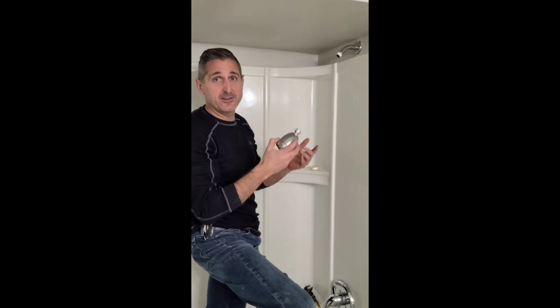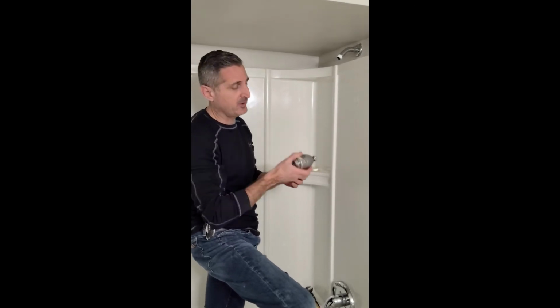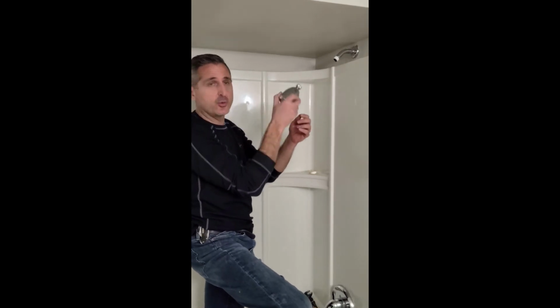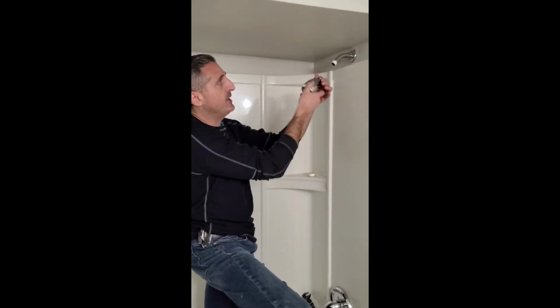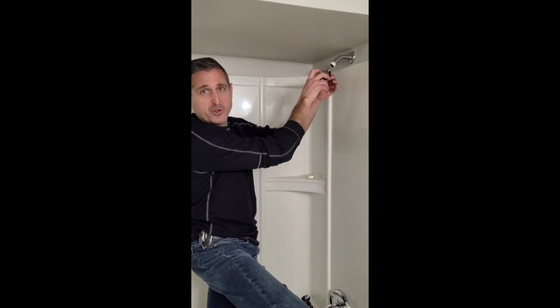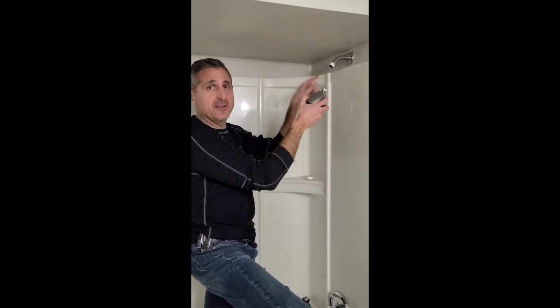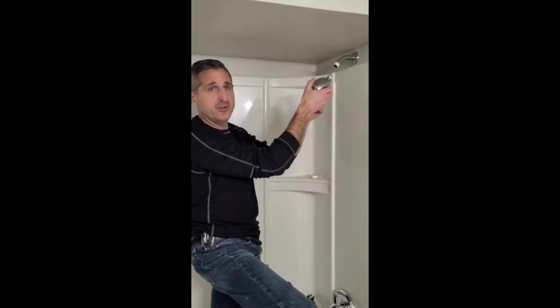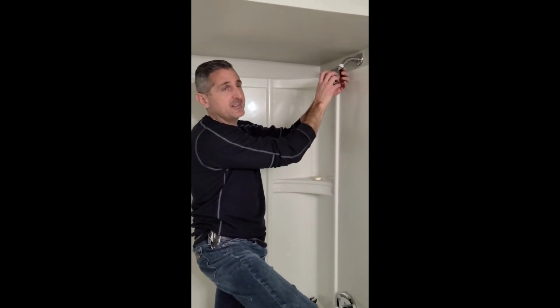That's a good way to always figure out how you tighten something or how you loosen it. So when I spin it on to the right, I go clockwise with the tape so that it will not peel the tape away. If the tape was on the other way, I'd be tightening it and it would peel the tape. Hope that makes sense.